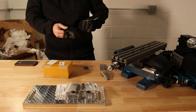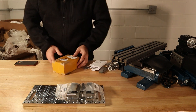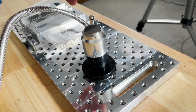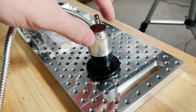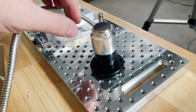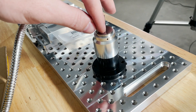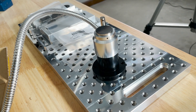As I mentioned earlier, there is more than just the machine if you want to invest in a CNC mill. I also purchased a touch setter probe for quick and easy tool changes. This will be attached to the machine or fixture plate — the tool comes down, presses it, and the machine detects the press and understands the difference in length between one tool and another, allowing very quick tool changes. There's also a nozzle — you attach air to this, and when the tool contacts the touch probe it blows chips off the end of the tool, keeping it clean so no debris skews your accuracy.